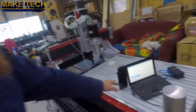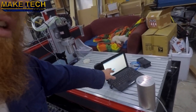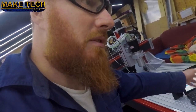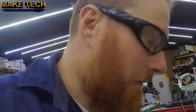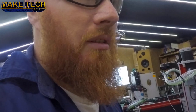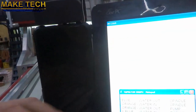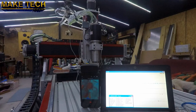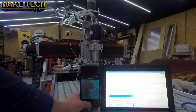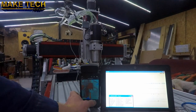This little rig I've got up here is a thermal image camera, and then I've got a 6-channel temperature logger. I made this years ago for testing some electronics. I've pulled it out and hooked it up — Windows XP laptop and an Arduino Nano — and I've used the 6 analogue inputs on the Arduino Nano to do serial monitoring. I've got it set to celsius times 10, so that's like 16.5 degrees, 18 degrees, with labels in the text box. We've got water in and out of the spindle and water in and out of the reservoir and radiator. I'll set up the thermal image camera and we'll do our first run with all this temperature monitoring.